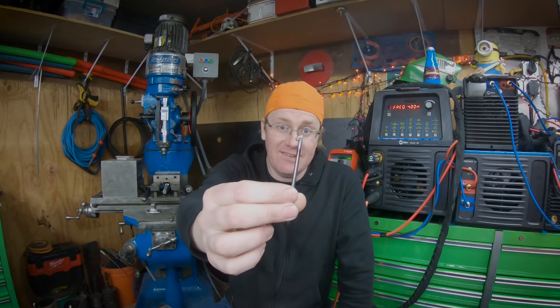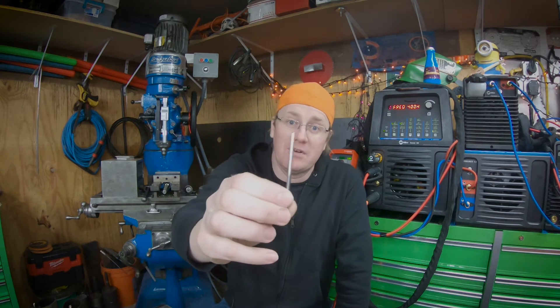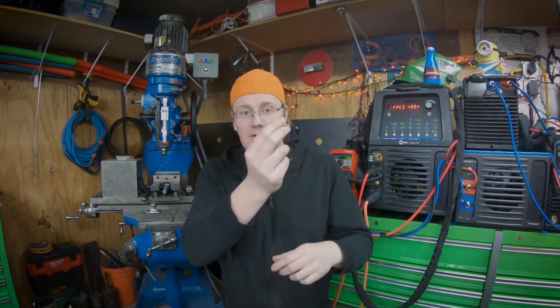Hey everybody, Darlington Farm here. I'm just out here in the shop and I just destroyed $30 worth of tungsten balls from McMaster. It's been a real great few minutes — needed some camera therapy. Basically, I'm making some little hardness probes for the university here. It's a real easy part. The first one came out just slick — I made a fixture on the Bridgeport behind me with a ball end mill, milled out a slot for the little rod to sit in, then TIG brazed the ball on the end of it. Real simple, first one just came together right like that. But I just can't seem to make the second ones work.